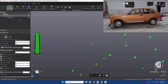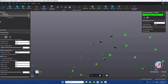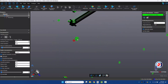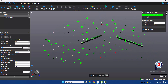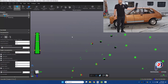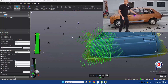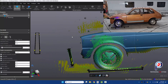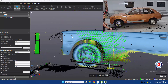We're finished acquiring the targets. Hold down the button on the back of the scanner and you can visually see how well you've captured the targets — if you haven't spent enough time on them, some will appear red. That's fine; you can carry on, and after you've finished scanning it will optimize anyway. Hold the button down again on the back of the scanner to start the actual scan session and begin acquiring real data. If it's losing track, it just means you don't have enough targets visible — you always want to be looking at targets for it to work.